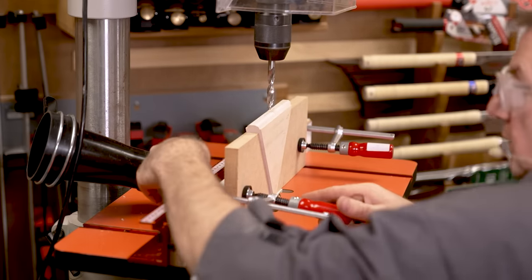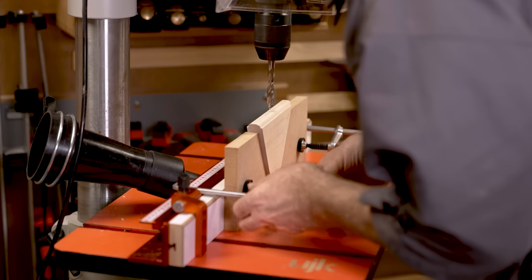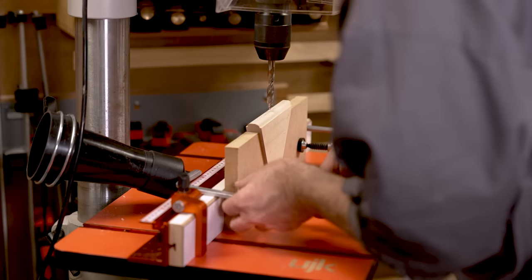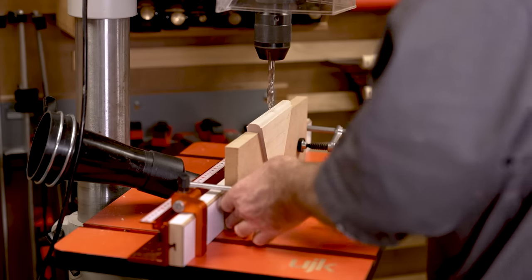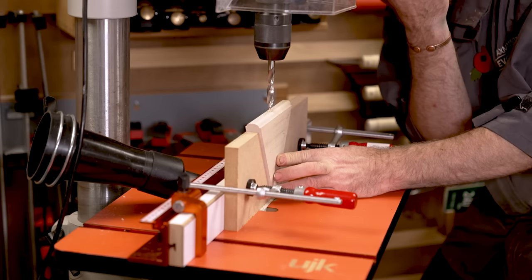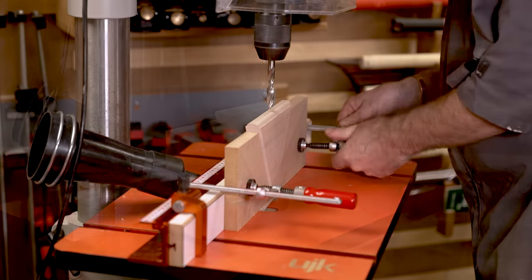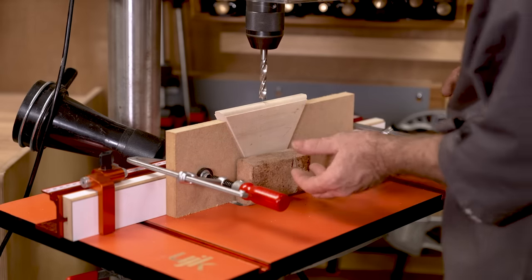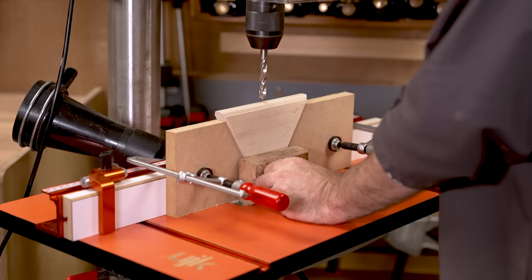Lock off our other one, let's find where I'm clamping on. I can see what I've got, okay. Let's check, nope, not on that one. Too far up, that's better. And I need to check I can get these in and out, I can support them. Need to just double check I'm parallel, that looks good. Tighten things up. So we've got all set, centre line, height. I'm just going to use a cork block. I want something to use as a pressure pad down here. That's easier than me trying to get my fingers in there. Feels good.